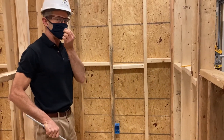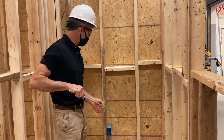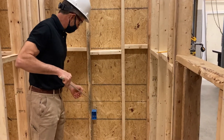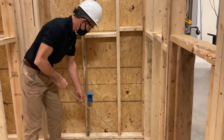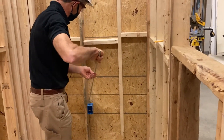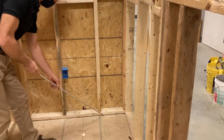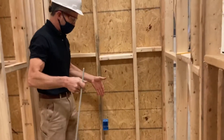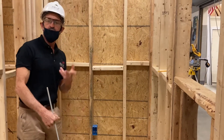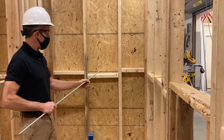The main point of our fire safety is to try to contain the fire and slow it down as much as we can. If the fire starts here at this electrical receptacle and the wires got hot and started a fire in this wall cavity, we would have it sealed off with insulation all around the electrical wires. Where there are holes, we'd seal them with spray foam insulation all the way around. They would also seal the bottom plate with spray foam so that if it gets really hot inside the house and a fire starts, we're not drawing in cold air and fanning the fire. They try to seal off every cavity as best they can before they put the batt insulation in.